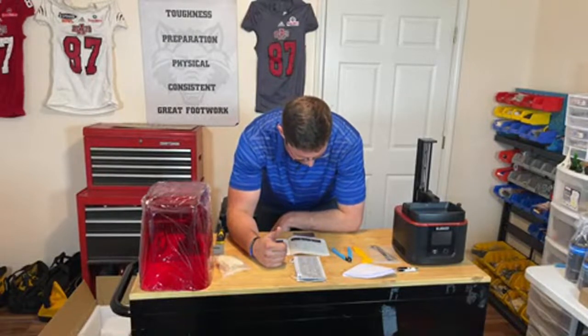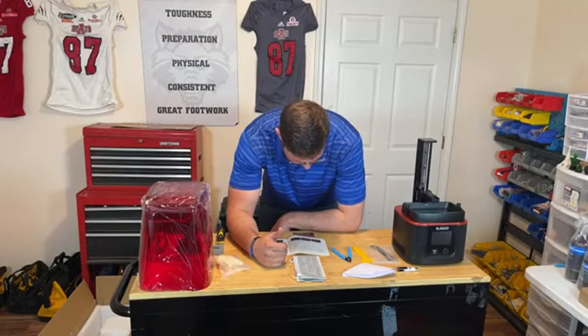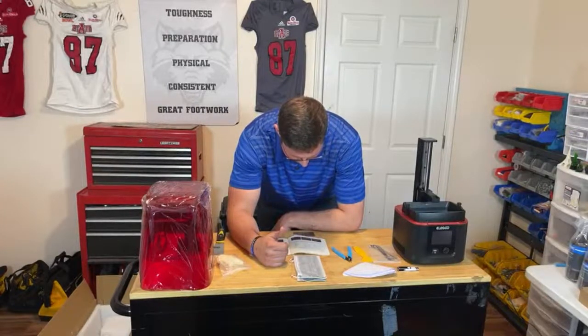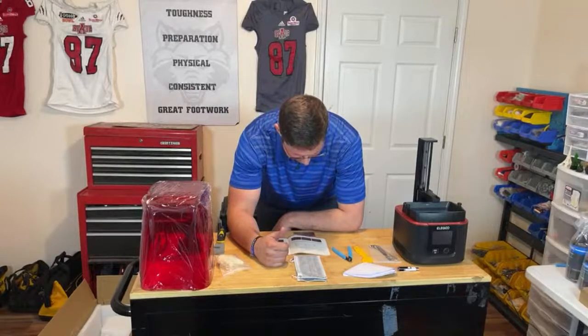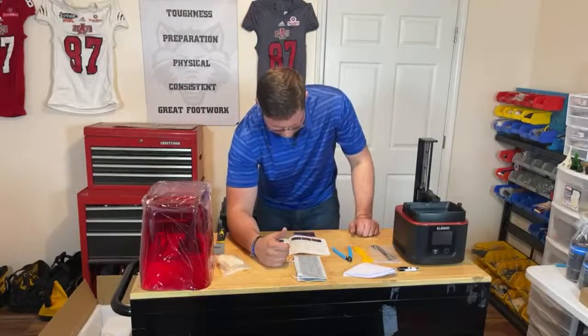Turn on the 3D printer. Please insert the build platform. Fasten the rotary knob and loosen the screws. Remove the resin tank and put an A4 paper between the build platform and 4K LCD screen and click move axis to zero. When the build platform stops, please use one hand to press it and make sure it's in the central position, then fasten it using the Allen wrench.